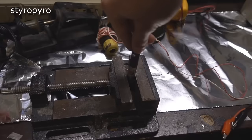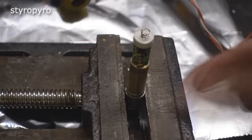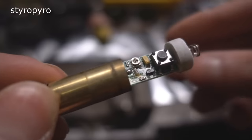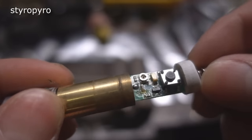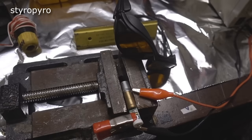These laser pointers are typically press-fit together and usually come apart fairly easily with a vice. Here I've pulled out the laser module and exposed the driver. There's a small part on the board that looks kind of like a screw — it's actually a potentiometer, and it controls the amount of current going into the pump laser diode. Hopefully turning it will give us more power. Let's see if this little mod is going to work.